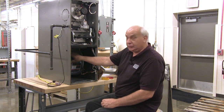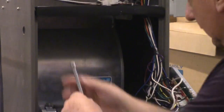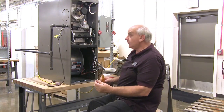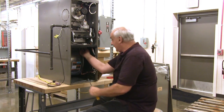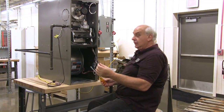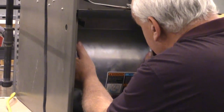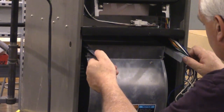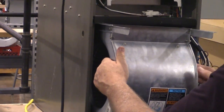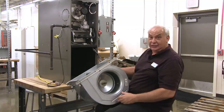This is the squirrel cage and blower motor. There are two screws that hold this in, and in this case we are going to take our 5/16ths nut driver — they are located right up here at the bottom. We reach in, unscrew the first screw, and lay it up on the shelf so we don't lose it. There is a screw on the other side as well. Reach up and unscrew it. Now I'm ready to pull that whole assembly out. I grab it and slide it back, it will drop down — watch your wires, keep your wires out of the way. Slide the housing back and very gently pull, and the entire squirrel cage housing comes out of the furnace.